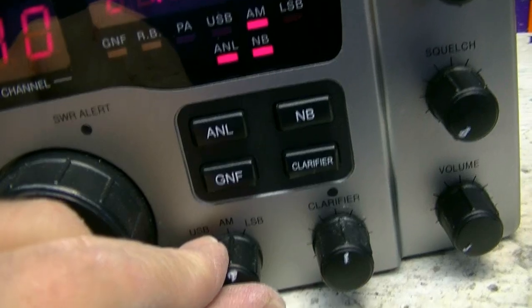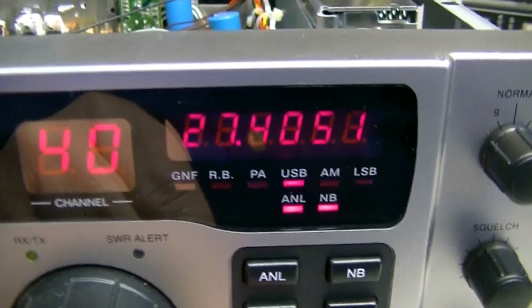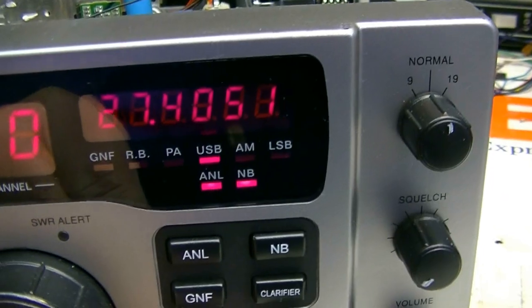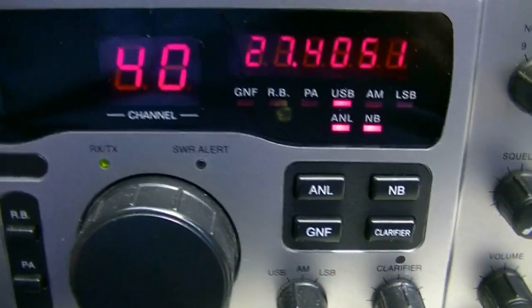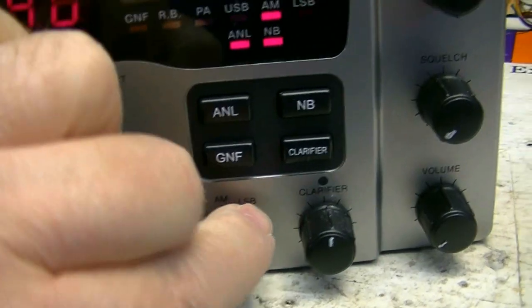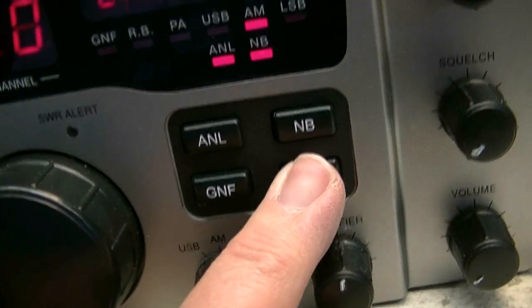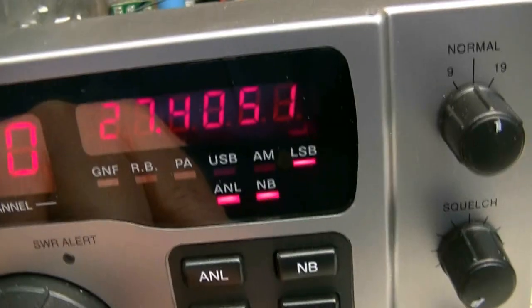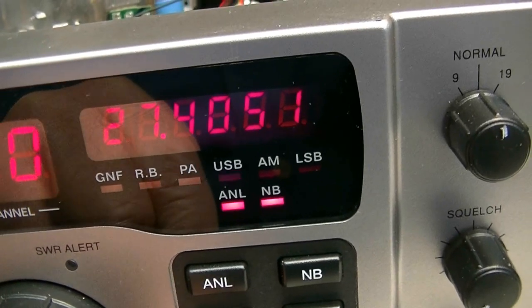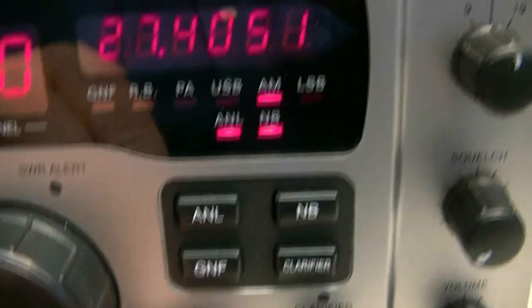Let's see - that's lower AM, upper side. Your counter is just a tiny little bit off. I couldn't quite bring it all the way in, but it's real close. Just remember when it shows a one on the end there, it's actually on frequency. Your counter is dead on 405.1. It's been running for about an hour and it's drifted 100 hertz, so I'll go in and take that out.